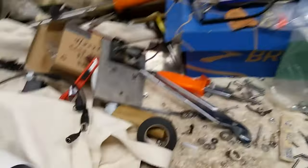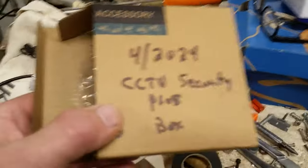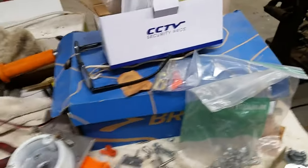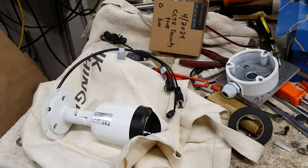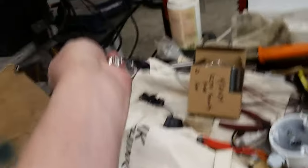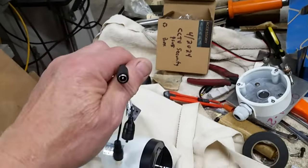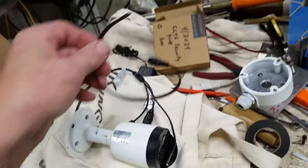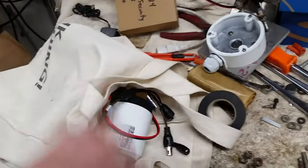This is the new camera from CCTV Security Pros, along with a housing. I've marked the box with when I bought it and where from — so the next time it fails, I know what I had up there and what works with my current DVR. It has a standard BNC and standard power connector, but I really don't want to have to climb the tower to find out the connector is wrong, so I'm also bringing up the whip they sent with it so I can patch it in — that's why the wire nuts.